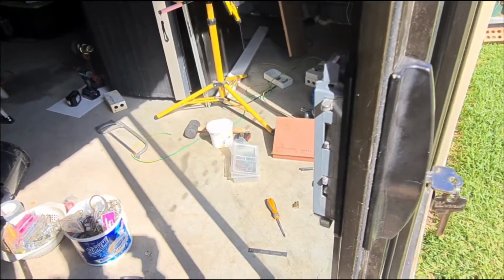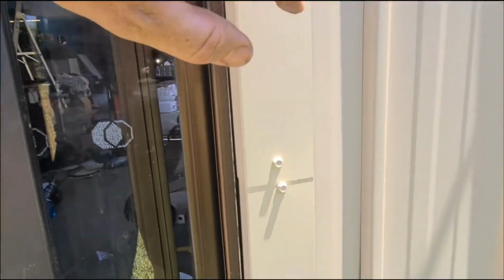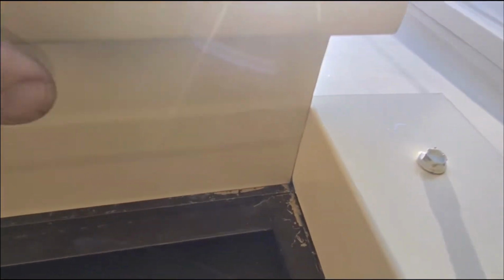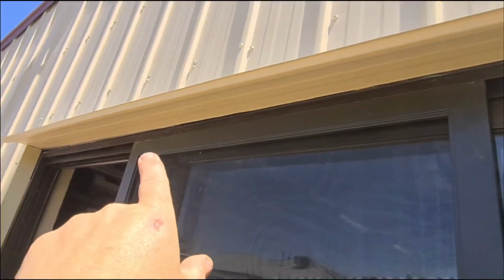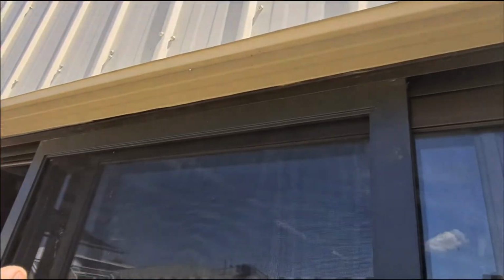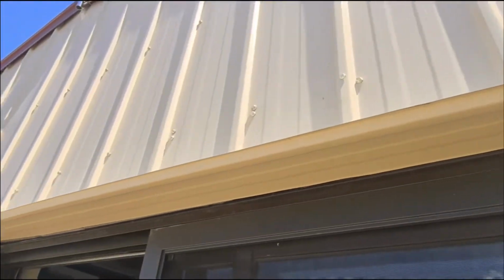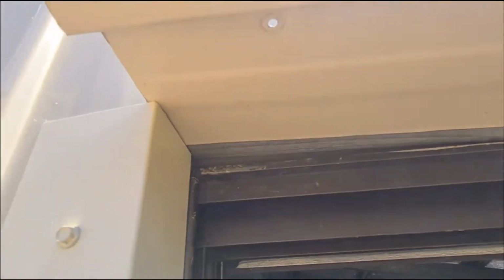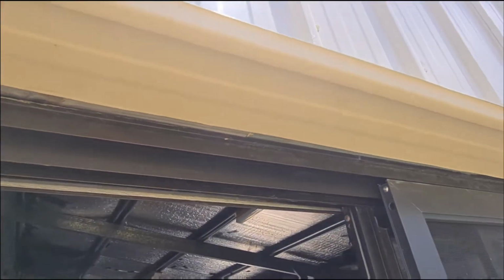Yeah, all good. Okay, so I've put the side flashing on. I needed 3 pieces on here, and I've cut this out now. I made it into, it's part of this wall here. I've cut a strip. It's not perfect at the end, but it's pretty straight. And I'm going to tap it in there. I'm going to use this as my channel to get rid of the water, either end. You need that to get rid of your water when it rains, so it doesn't fall on top of you, and it'll drip outside the area, so you're not going to get wet when you run out of your shed.